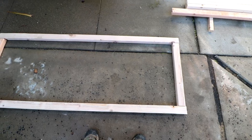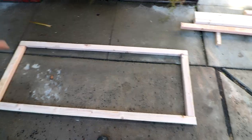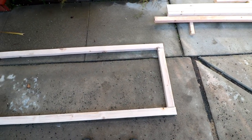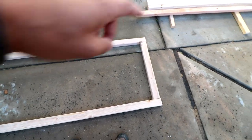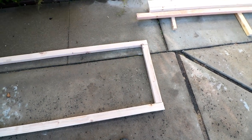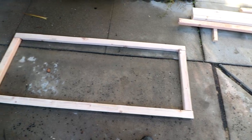That's going to be the top frame of the bed. I've got it six feet long — 72 inches by about 30 inches wide. I'm going to get that screwed together. I'm going to use pocket holes on these boards going into the long ones, put some wood glue in there, and let that sit up.